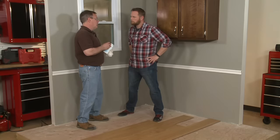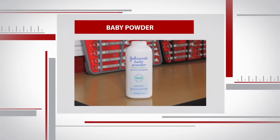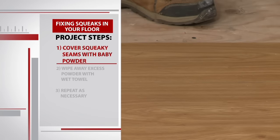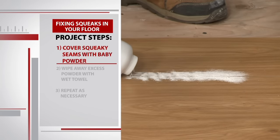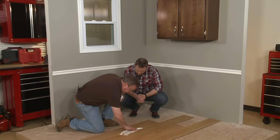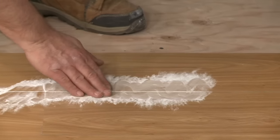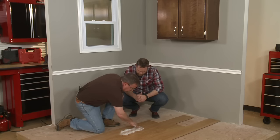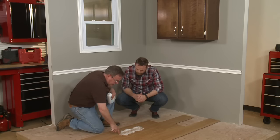It's the wood flooring itself sliding back and forth on the fastener. To try to get some lubricant into the space between the fastener and the flooring, we're simply gonna sprinkle some baby powder on it. Let's say our squeak is in this particular crack — you're just gonna take the baby powder, move it back and forth until it gets into the crack. Pound on the floor a little bit. All you're trying to do is get the baby powder down in between the two boards.